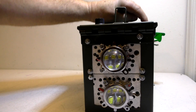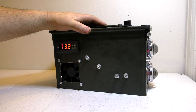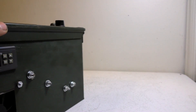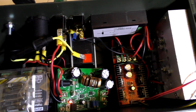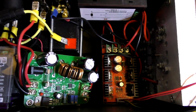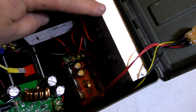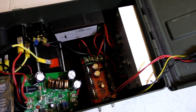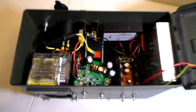Now I'll show you outside the Fresnel lens. If you put it in front of it, it tightens the beam up — unreal. This is kind of a wide-angle beam. You're talking about 12 inches there, so it does widen up quite a bit. It's extremely bright. Everything is placed in a decent location — I was able to fit everything in there. It's pretty well self-contained, and the battery lasts a lot longer than I thought. The fan cools these massive aluminum heat sink blocks quite well, and you can literally run it with one light on half throttle without the fan turning on.